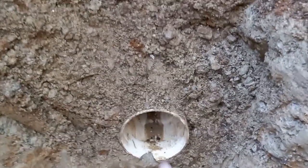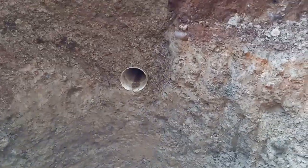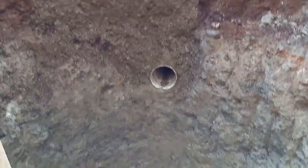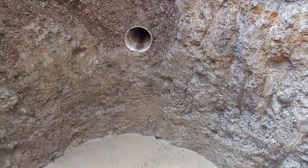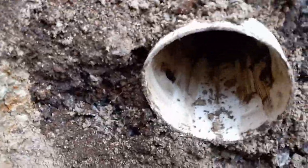Right here to this part it's 20 inches. What's required in Vancouver — I think 17 or 18 inches in most municipalities — so I'm giving it 20 inches. This is the line that comes in; you can see it's a drain tile.